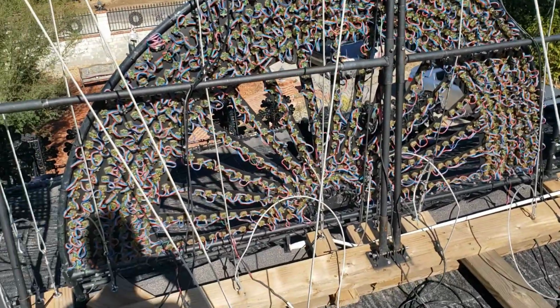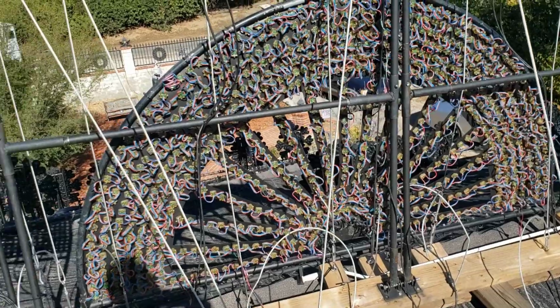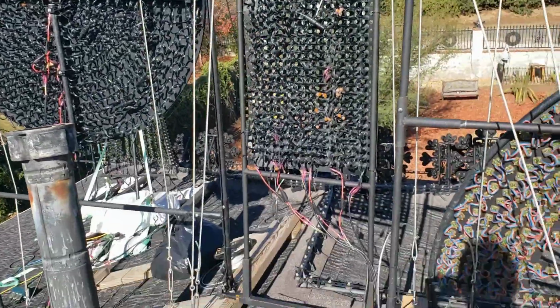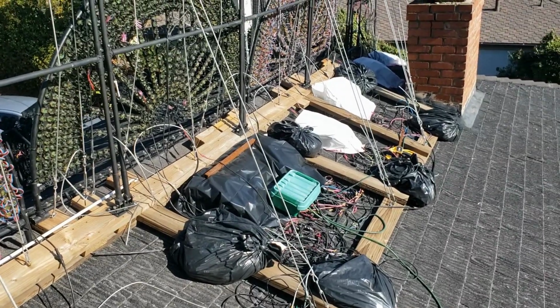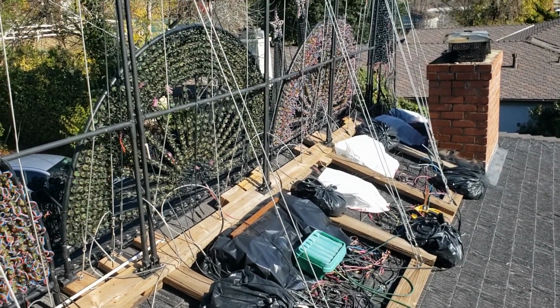So I try to limit no more 12-volt pixels than, you know, the 1117 that are on the Mesmerizers, the most on any one power supply. It kind of bit me this year because of the AC draw, but it's a lot safer to keep the power supplies underutilized overall. That's about it.